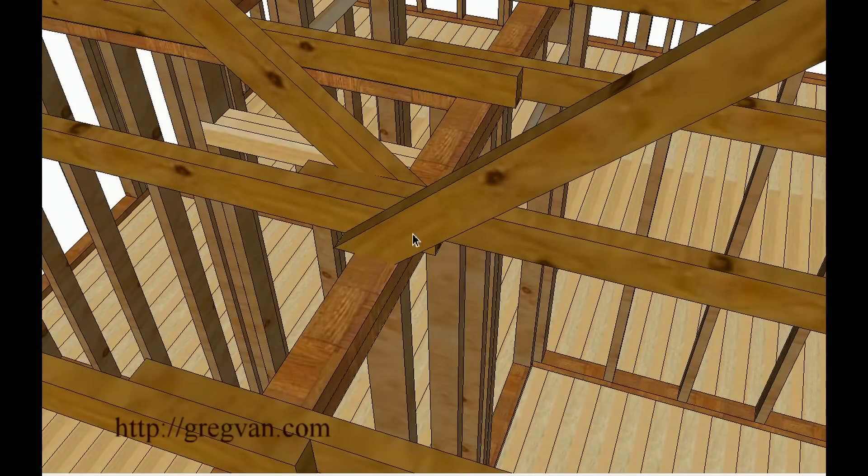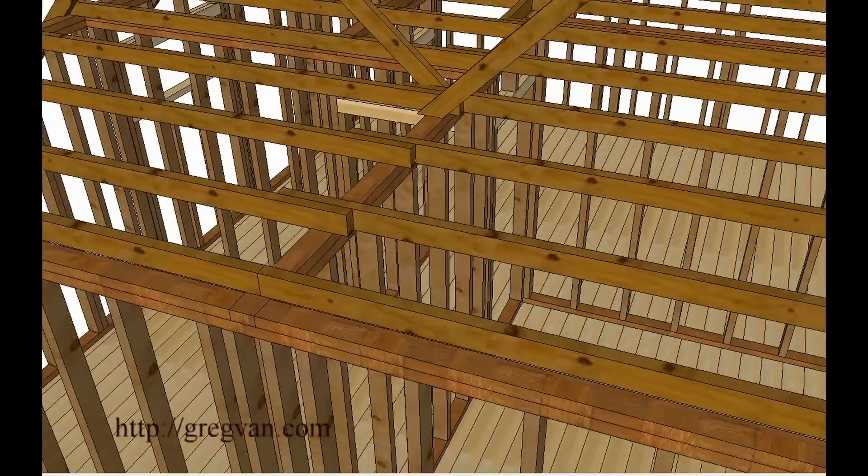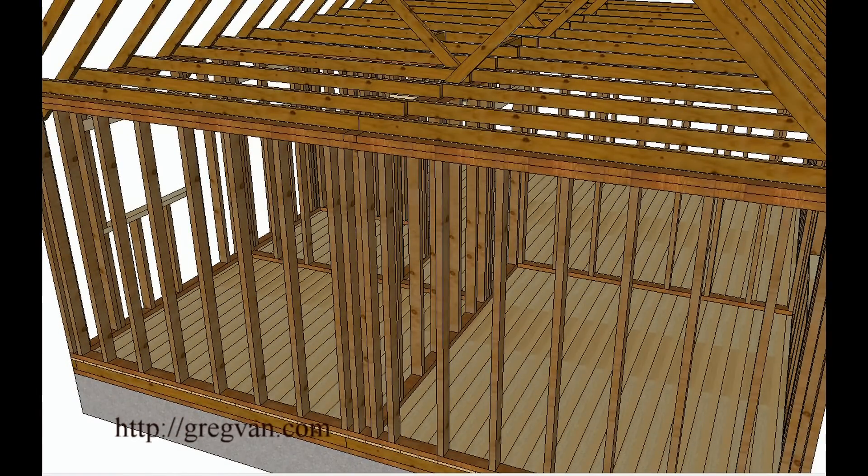You could put a couple of nails into the ceiling joist and a couple of toenails into the wall, and I would imagine that would be sufficient. I'm going off of what I used to do — this is a common method for roof purlins.